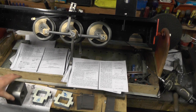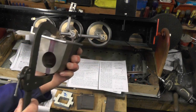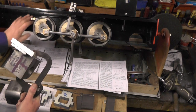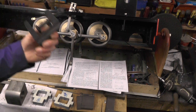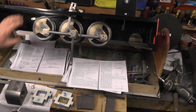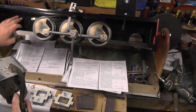What I've done - the way I'm doing this - I've got this piece of aluminium plate here. It's actually clamped to my cylinder now ready. I put that piece of plate onto my frame to cover those holes and lightly clamped it with this plastic clamp so I didn't spoil the paintwork. While it was clamped in position, I've transfer-punched all the holes from the frame into the plate and drilled them.